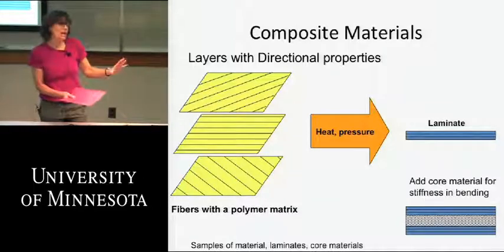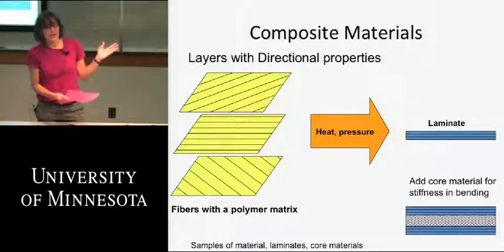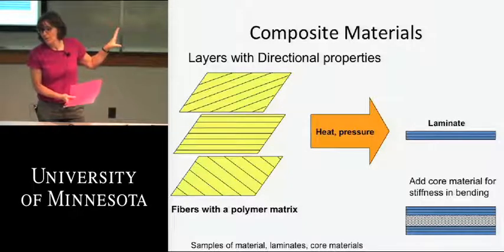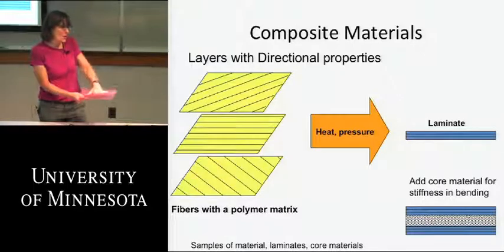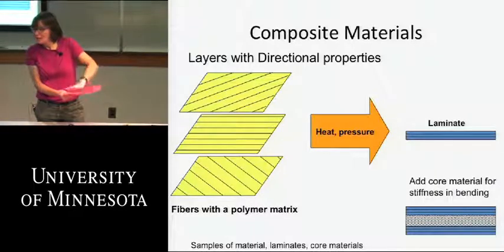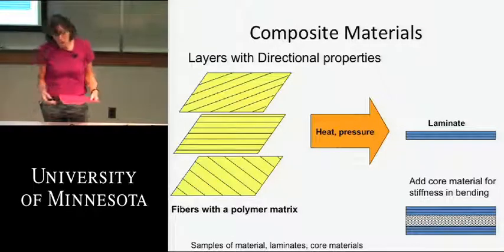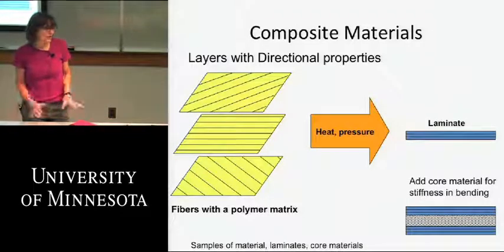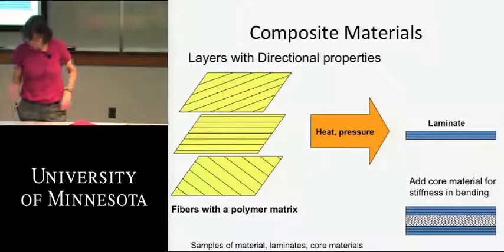It's still better than anything else you're going to get. So that's why people go for the pre-preg. I'll just say that it's pretty tough to make, and I don't think I've ever read that they make wind turbine blades from a pre-preg. But if you're learning about composites, then this is kind of the classic, the ultimate, the standard. They will do pre-pregs on airplane wings, but they won't do it on a wind turbine blade, because it's just difficult to get all of that shape in while using a pre-preg. So I'll show you how they do that in a minute.